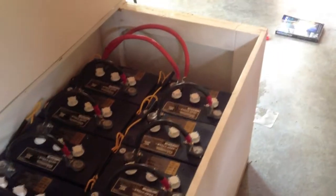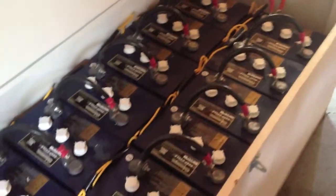You can see the reflection of the liquid right there — that's the battery demist oil sitting on top. You don't want it all the way to the top; you want about half an inch or more just below there. That's all of them. They're in perfect shape, completely maintained. There's no buildup around any of the terminals. Everything looks good.